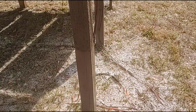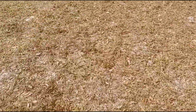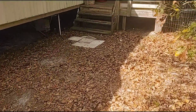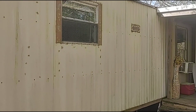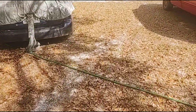I did a direct burial underground — no conduit. The wires come off the system and go directly into the ground, about eight inches deep. I ran them along this path underground for roughly 150 feet, then brought them in just to the right of this window — about eight feet to the right — and drilled a hole directly up through the wood floor and ran the wires up to connect them to the solar processor inside.